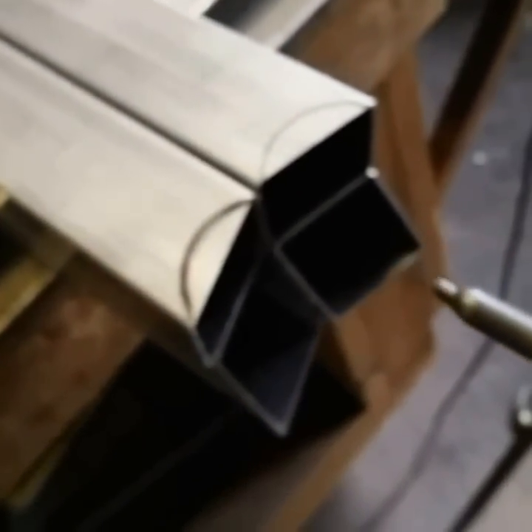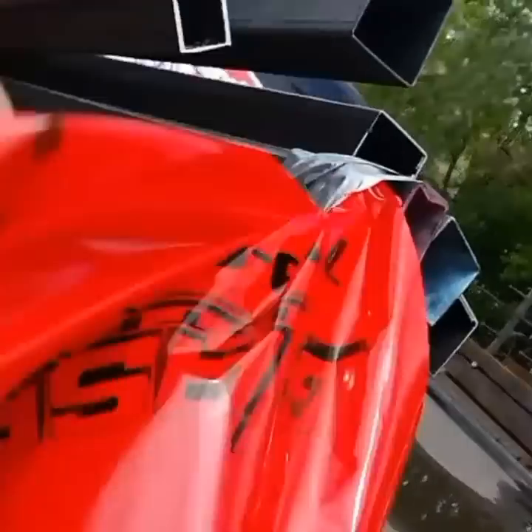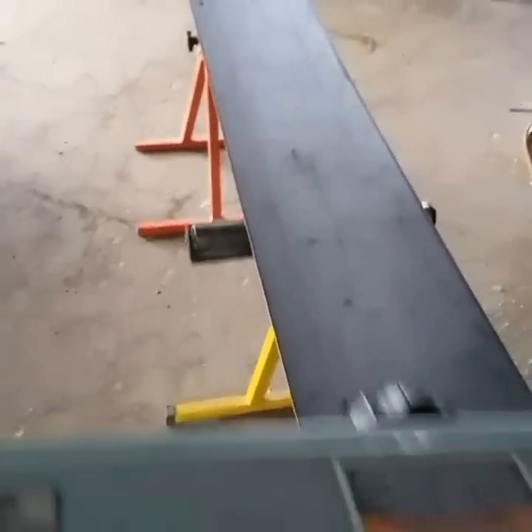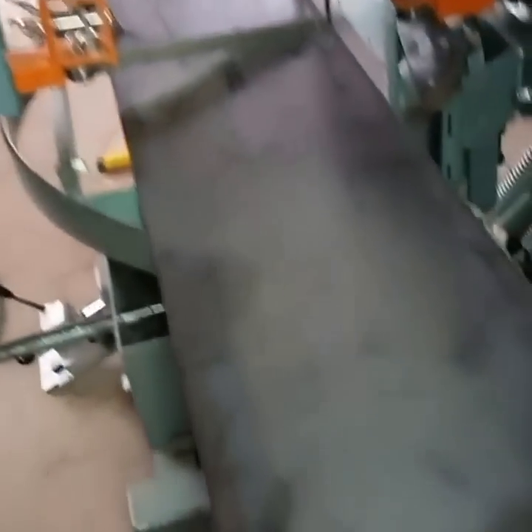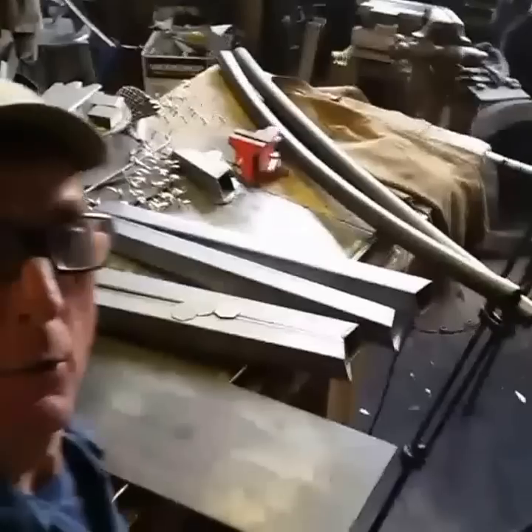Just like we do on our rocking chairs, we notch these things out prior to the welding. We've got four caps, four legs, our two rockers — we're missing our plate. We need a ten inch by three-sixteenths plate. We got to flip it over and finish this cut. There's our plate, we just need to drill it — our legs, our caps, our rockers — everything we need.